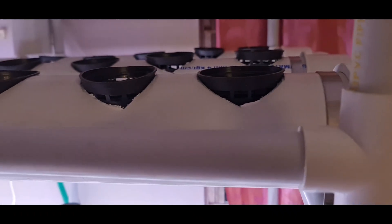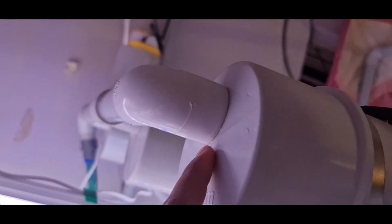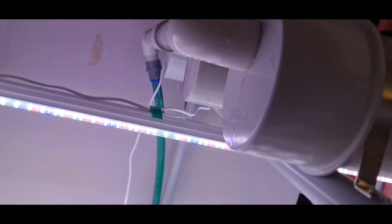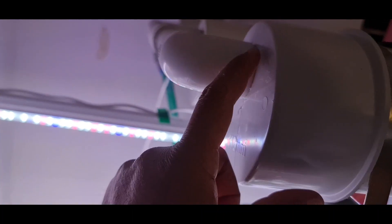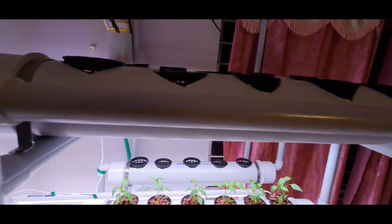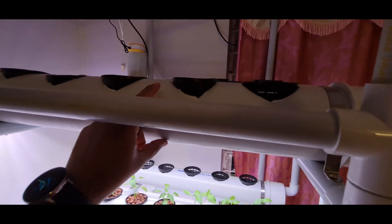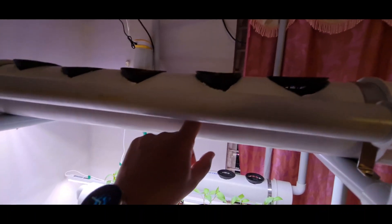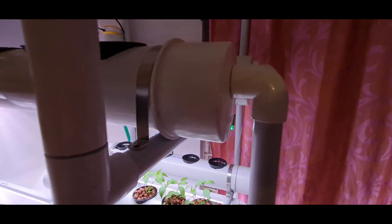You can see that once the water is filled here, I have placed the inlet tubes slightly above the level of the midline. I have kept the inlet above so that water will collect up to that level. Once the water is filled to three-quarters of the diameter, the water will then outflow.